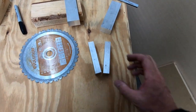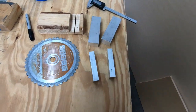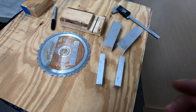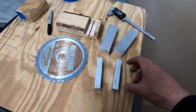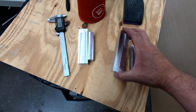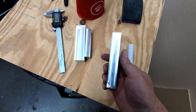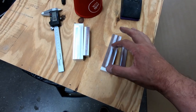It's almost perfect. So anyway, now that I have the rough cut parts made, what I'm going to do is go over to my mill and just mill these down to their proper thickness and width. So I'll go ahead and cut these down, and I'll show you what it looks like when I'm done. So I finished milling these blocks out to approximately the proper size before we start cutting the sections out